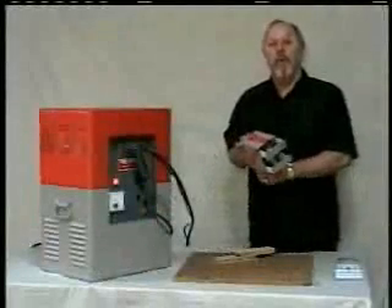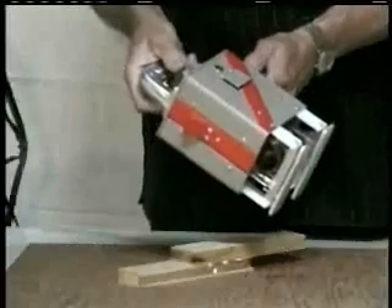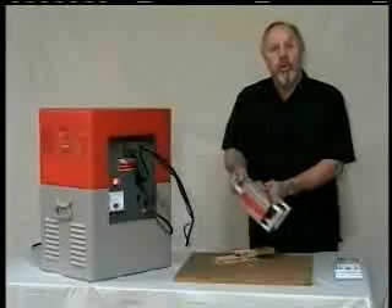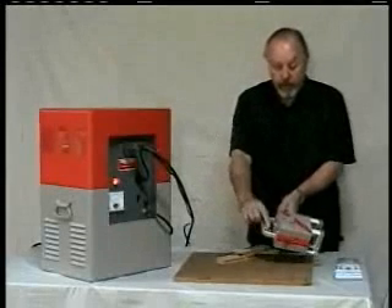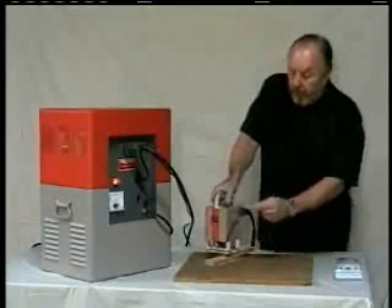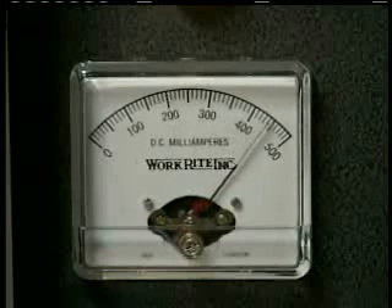Understanding that we're dealing with a radio frequency, it is truly like a radio. We have what we call a thumb adjuster — this is a compensator for the density of the wood, the type of wood, the thickness, the amount of glue, all of those things. So every time you're using this, you're pulling the red trigger and moving the thumb adjuster. The thumb adjuster will allow you to get high heat on the milliamp meter, meaning you will do the weld quickly.